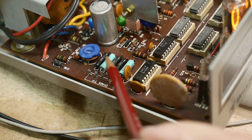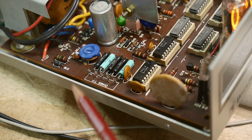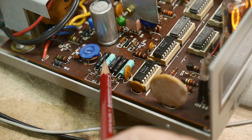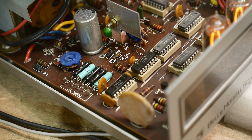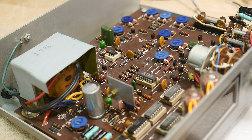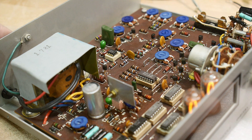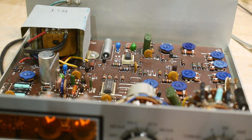They are right down here — here are your calibration standards with little test pins. When calibrating resistance you just clip the clip leads on here and set the full scale correctly. For example, for 200k you put the clip lead on here, then go over to the 200k pot and adjust it for full scale — that's all you do. This thing was really trivial to calibrate. Very simple design.